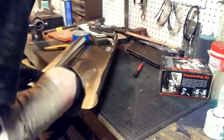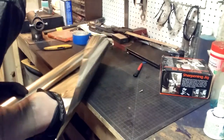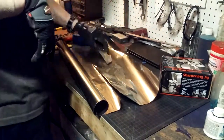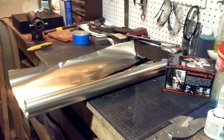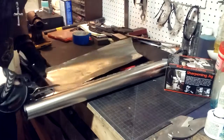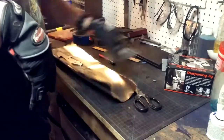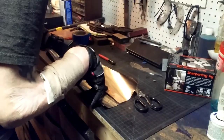Do my normalizing now. This is 321 stainless steel tool wrap. 309 is the one that they use for like CPM 154, D2 and all the stainless steel heat treating. This is used for carbon steels. A lot of people I read use it for heat treating, but I don't understand because they say you have to cut it open and let the knife drop into the oil. That just doesn't seem right to me.